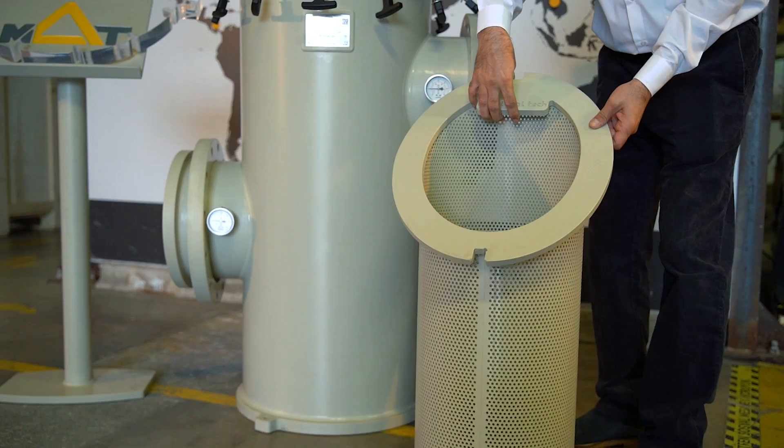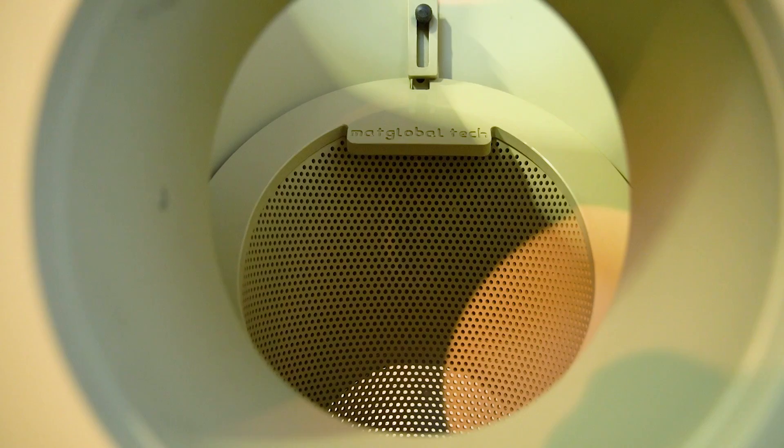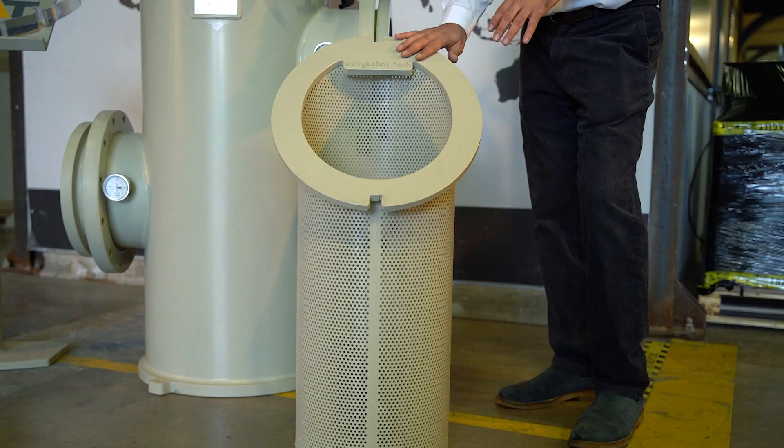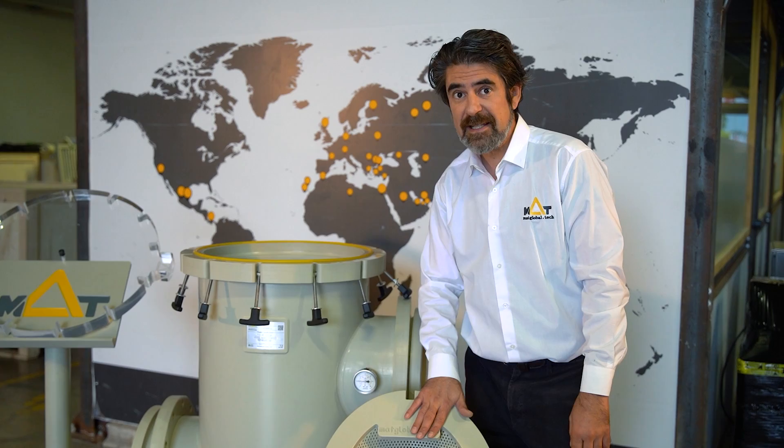On the polymer structure we can start with 500 microns up to 20 millimeters hole size. All the baskets in the standard series are four times bigger than the flange cross-section, which is a good benefit to make sure our basket will not be clogging. It's also possible to go with stainless steel, duplex, and titanium baskets.